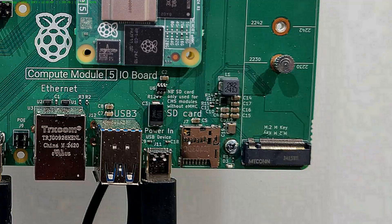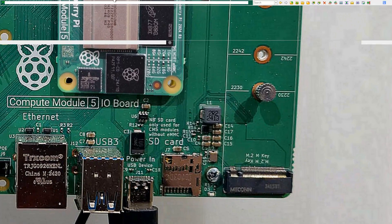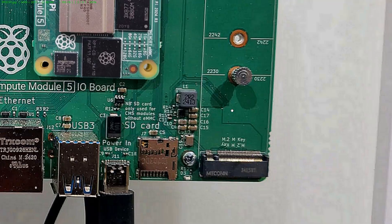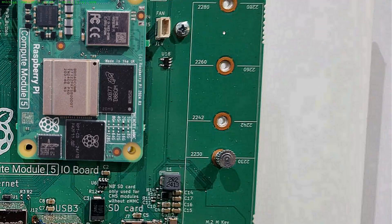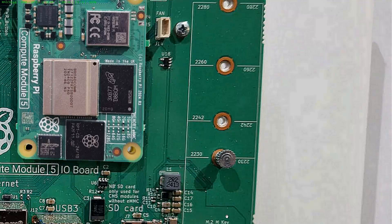About this SD card slot — you can plug it here, but only if you don't already have an EMMC module installed on your compute module. Here we have another connector that is very useful: it's a PCIe M.2 M-key connector, used for SSD drives. You have all the different sizes available, except for the size that probably nobody uses.